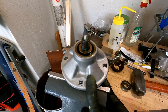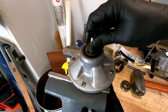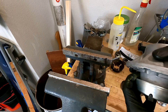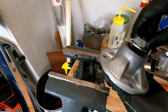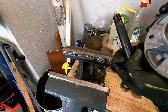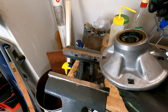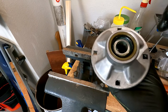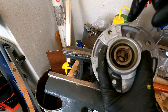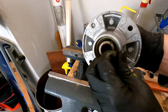It's definitely packed with grease. It's got a real nice seal on it. I just lightly tap on the shaft with my hand and it comes right out. That shaft is a real tight fit — not a press fit, but tight. Yeah, it's got grease in there. Not a ton, but these seal bushings are pretty tight in there. When this was new and you rotated the pulley, it would squeak real bad — not bad necessarily, but kind of loud. What I was worried about was that the seals weren't lubricated properly and that they were going to burn up.